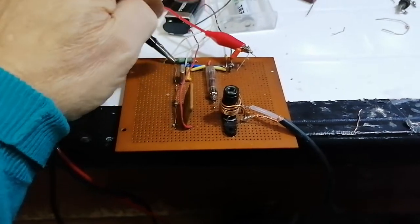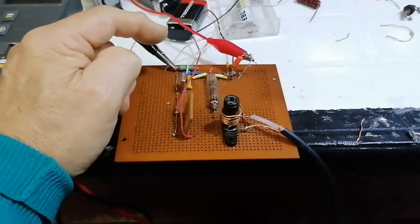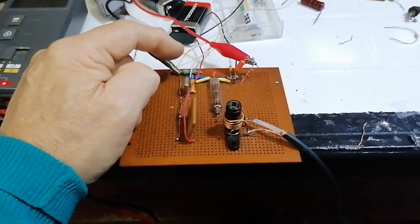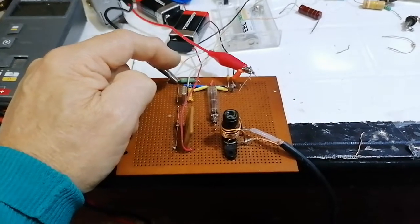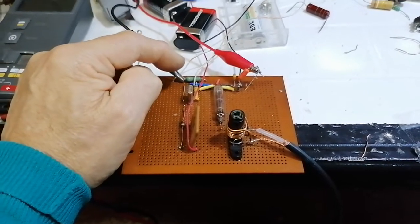We've also discovered a better way of taking away the hooking at the top. If we use the positive side of the heater, the filament, we seem to improve the sync tips rather than grounding it to ground. If we put it on the filament feed it's better.